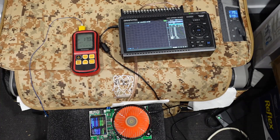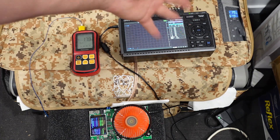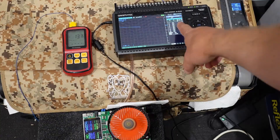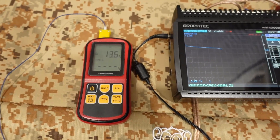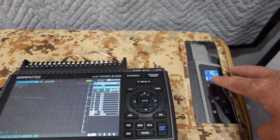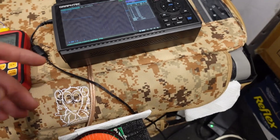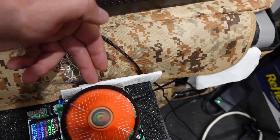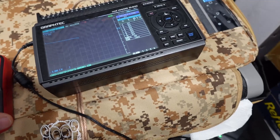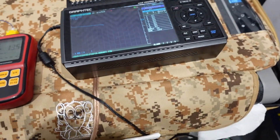The cell's been sitting in the cooler for a while. We're reading minus 17 on the cell; the cooler is reading minus 19. We'll start discharging it. Getting close to 1.8 volts on the discharge — temperature is now 13.6 degrees, so the cell has raised in temperature by about four degrees during discharge. The cooler struggled a bit to maintain temperature given the heat here. The power released when it was cold was 31.94 amp hours, which is just over 70 watt hours — roughly 73 percent of the capacity when it was warm. That's amazing; regular lithium is probably about 50 percent, so pushing three-quarters return efficiency is great.